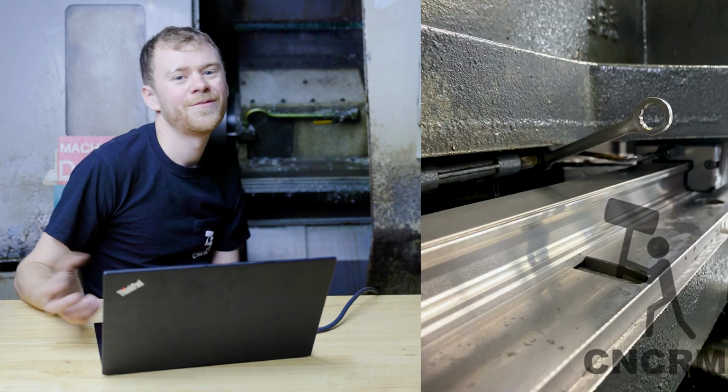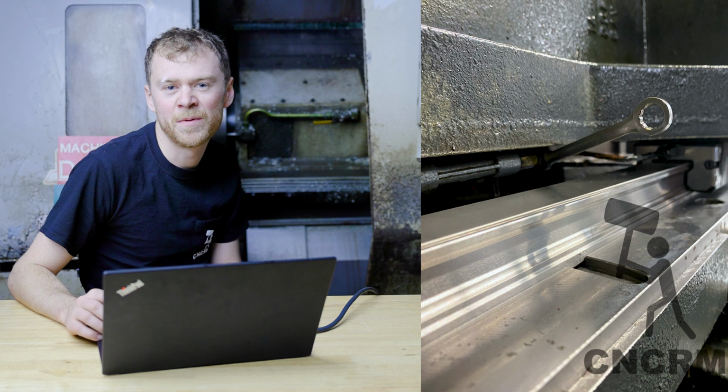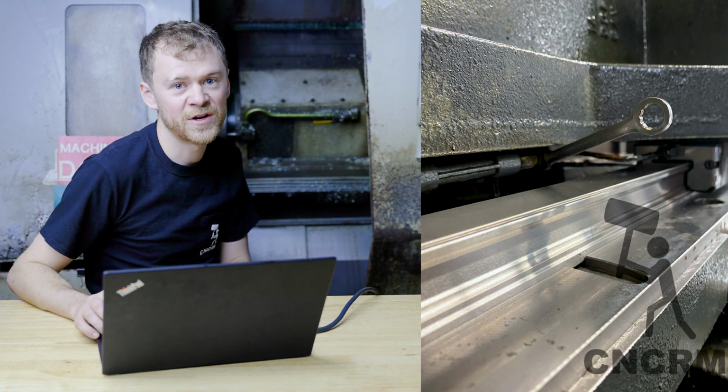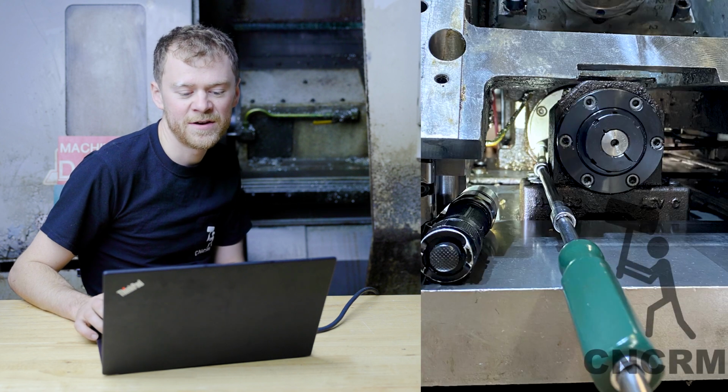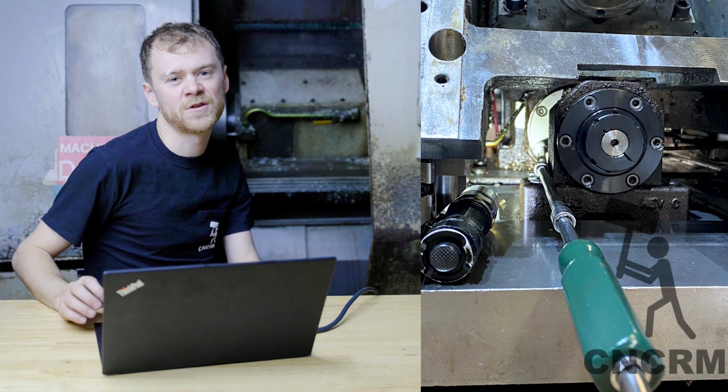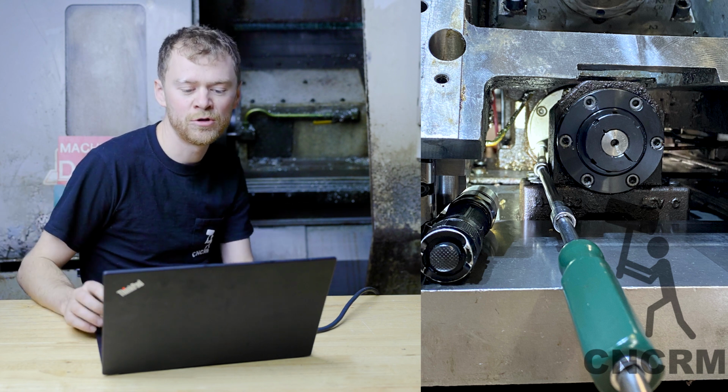Lube lines. You want to get yourself a nice set of 3/8 open end or 10 millimeter wrenches, grind the edges, grind the jaws. It's going to be tight working in there. So I kind of skipped forward here. Now I've lowered the wedge back down onto the trucks. I slid the trucks in, I got the lube lines in.